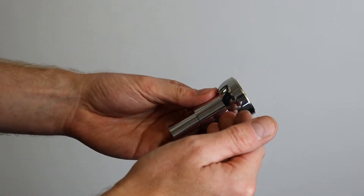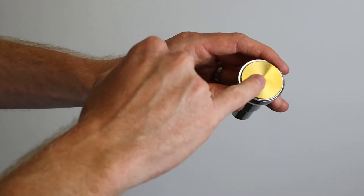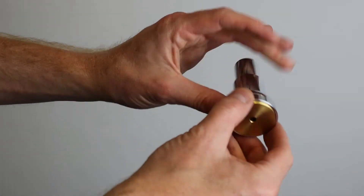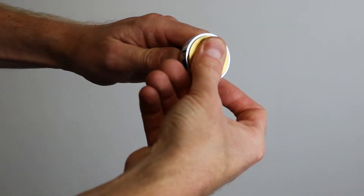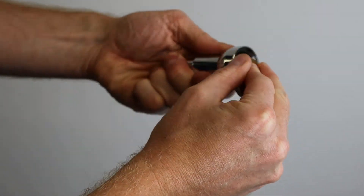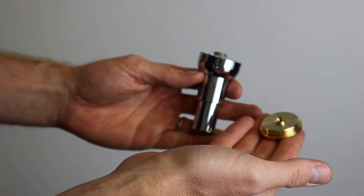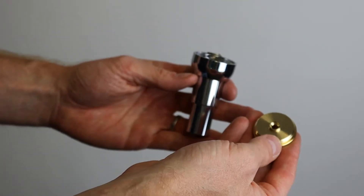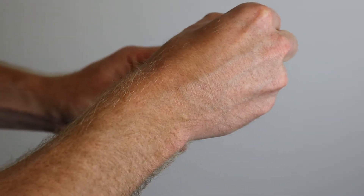The first thing I need to do is remove the brass base from the magnetic doorstop, because inside here is the fixing point for this product. To do that, push on the brass point and rotate it - rotate the bracket and it will unwind from the magnetic doorstop. Now you have the mounting bracket piece and a doorstop with a spring inside.